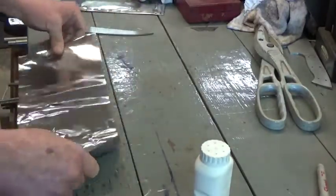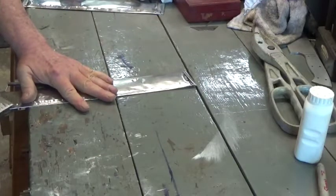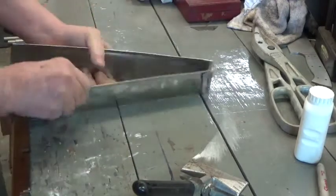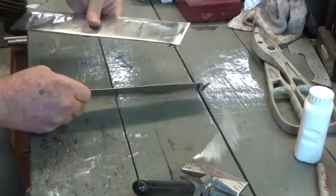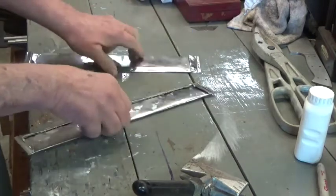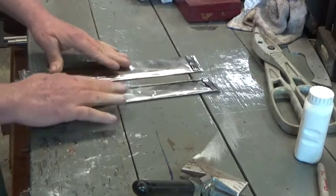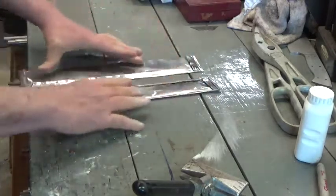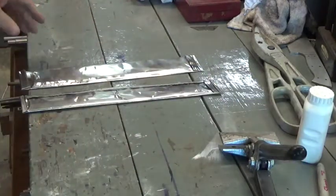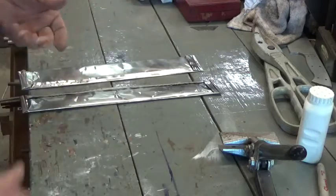Now we'll get Rand's knife wrapped. These are ready to get in the furnace. I want to put them in the same way — points forward — so they can go into the quenching block, with the blade part being sandwiched between the aluminum plates more so than the handles. We'll come back when it's time to put these in the aluminum clamps and get them quenched.